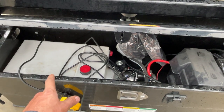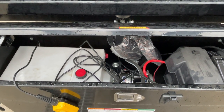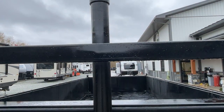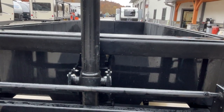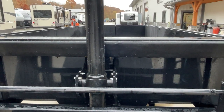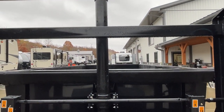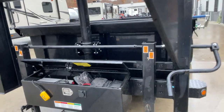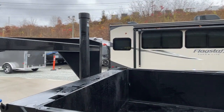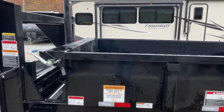On a power-up, gravity-down, it's going to send all the fluid out on the way up, and then it's going to put it all back in the reservoir on the way down — unlike a power-up, power-down, where it's a continuous circle loop and you've got a much smaller reservoir. So this is a very large telescopic cylinder. In the industry there are a few different ones — they use 108, some use 120s. If I'm not mistaken, this is a 144-inch stroke. It is a 12-ton cylinder — it's a beast. That cylinder would be more ideal on a triple axle or super single 10Ks, but this is also used even on the tandem 7K axle setup. So a lot of cylinder for what this is.